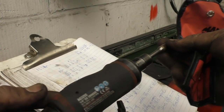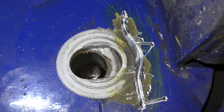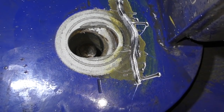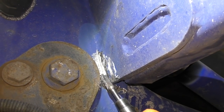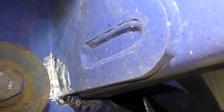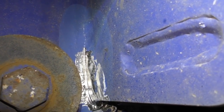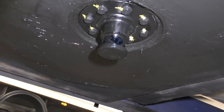You might have seen these in one of our videos at some point. This is to cut a groove that's following the crack. I've dug that in - that's about 5mm steel - and on a crack down here I'll cut this weld out and then weld it back. I can only just get in there with a MIG torch; I can't do it with a grinder. However, that tool is brilliant for doing these sort of jobs.